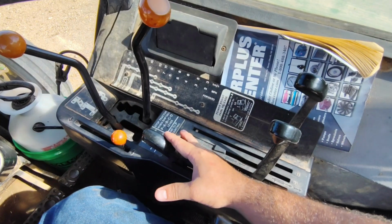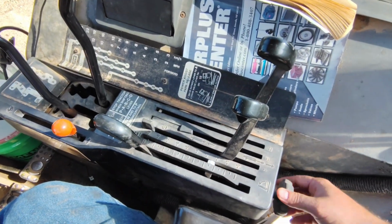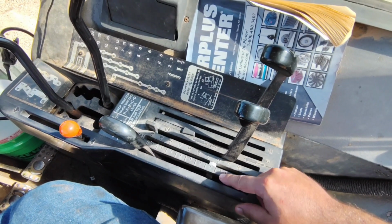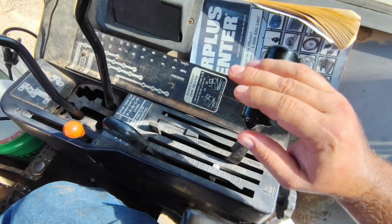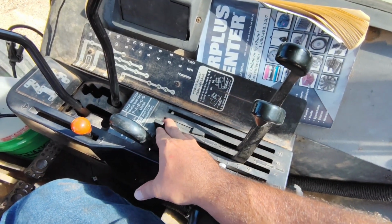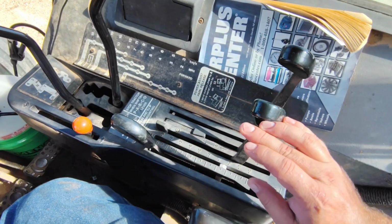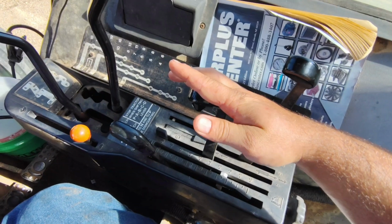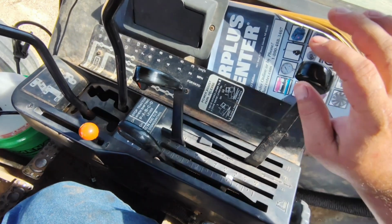As you'll notice, we've got our 3-point. With this adjuster, we can set a stop to stop at the same point. We've got 2 remotes in this tractor, left side remote, right side remote. You'll see this stop is to put it in float position or lock it out of float position. I use float position on the mower. I'll pick up the mower, and then there's our first detent to go down, but when I'm using this mower, I'll put it in float.